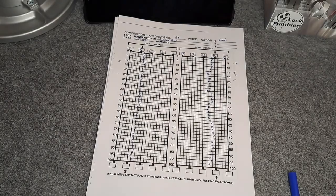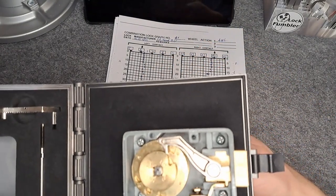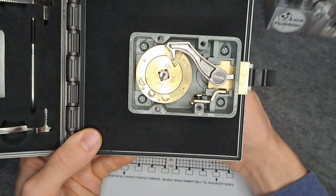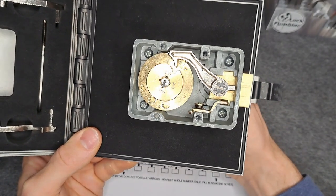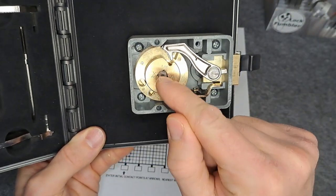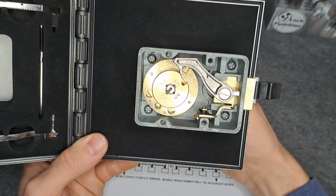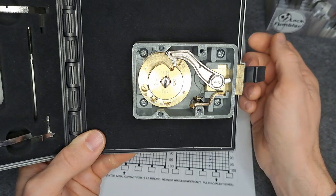So here's a graph, and yeah, I mapped out the left contact point and the right contact point. And basically the right contact point is, if you look at the Sparrow's vault again, the one that lifts the cam up. And the left contact point is the one that will pull the lever along for opening in the end. And what you see is the slope on the right contact point is a bit shallower. So if you're careful, you should be able to differentiate the right contact point a bit better than the left contact point, because the slope here is rather steep.